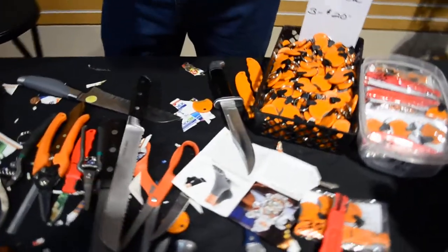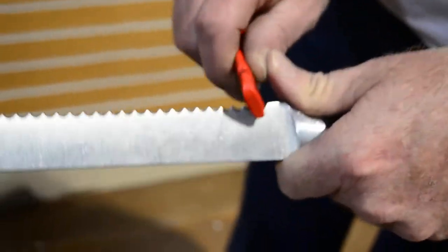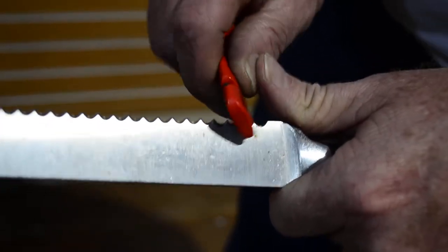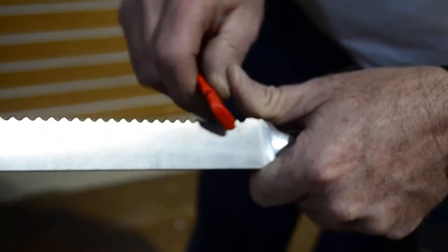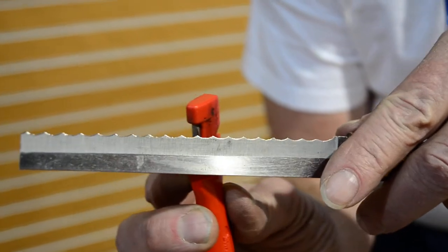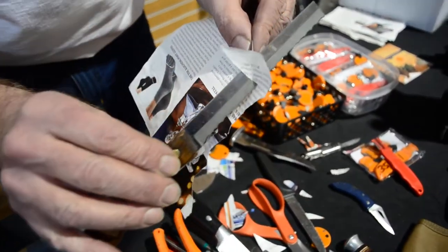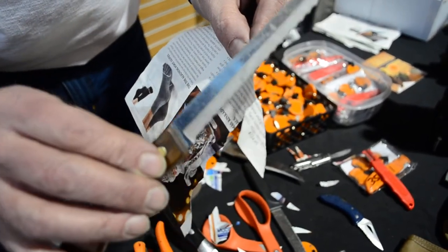So anything that has a blade, except for lawn mowers, saw blades, and drill bits. So all of your serrated edge blades like this — simply done by making a pivot out of your thumbs and going sideways just like that. On this particular one I'm going to go right down through there. On this one right here, because they're shallow holes, I'm actually going to just let it bump along — I'll slow down so you can actually see — just like this, right down through there. You might wonder, okay, you've done that, is it sharp?